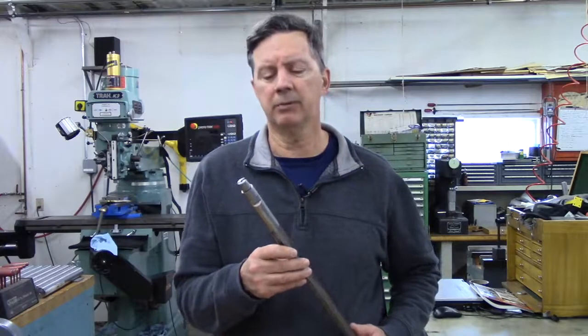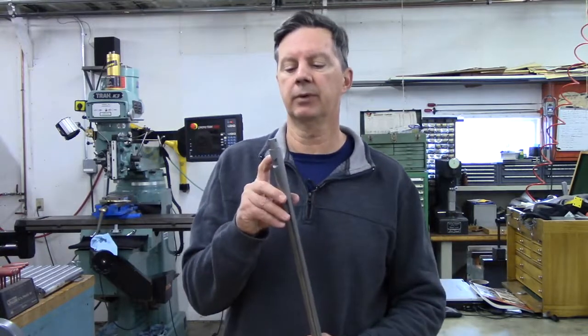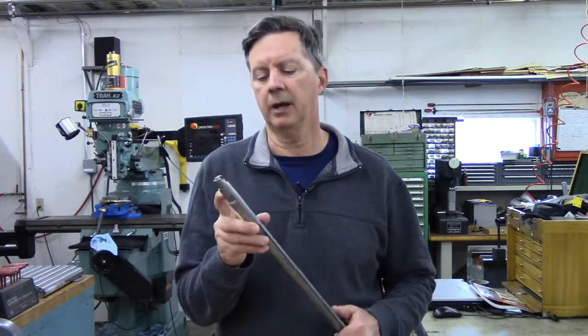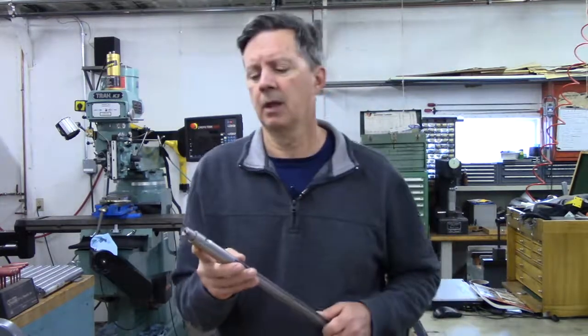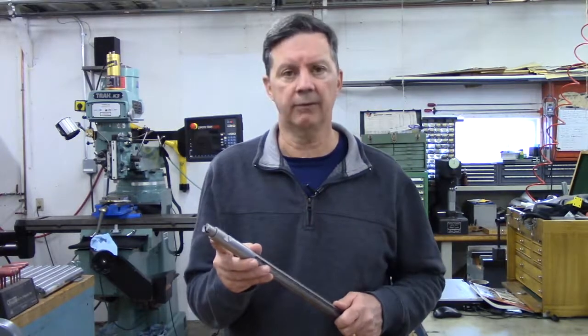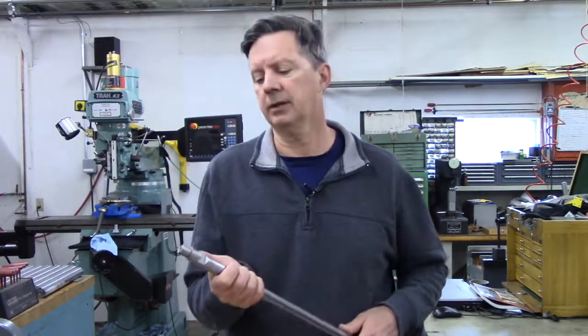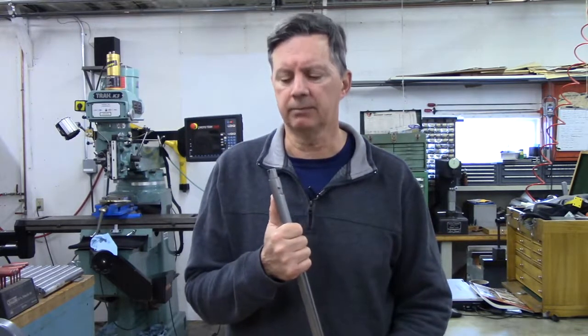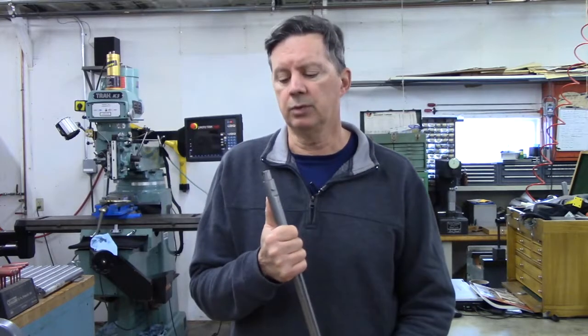Chambers are normally measured by first pouring a casting into the chamber and then measuring that casting on an optical comparator. The problem with that is, first off, most of us don't have an optical comparator, and secondly, that technique doesn't lend itself towards chamber casting a barreled action. Generally, you need to remove the barrel from the receiver and then pour it. And sometimes that's not a big deal. In a lot of cases, it kind of is.